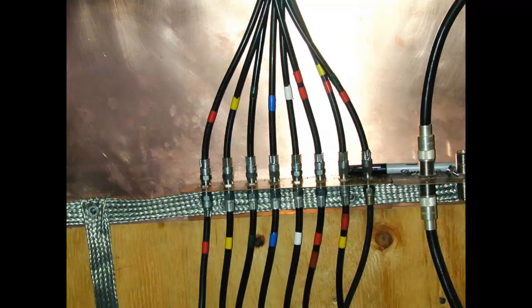So all these receiving antennas, the different arrays, there's several different arrays. These are not cables that come from each individual antenna in a given hub, but these are the cables that come from the different hubs, and they come up into the contest barn or into the house, and they're grounded as they come in. All the cables are grounded and everything's all bonded to the mains so that there's no potential differences in case there's a lightning strike or anything. And I really don't need any common mode chokes or any of that other stuff on this. It's just fine the way it is.